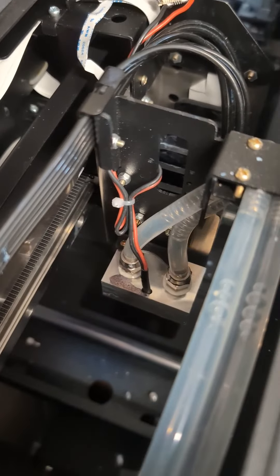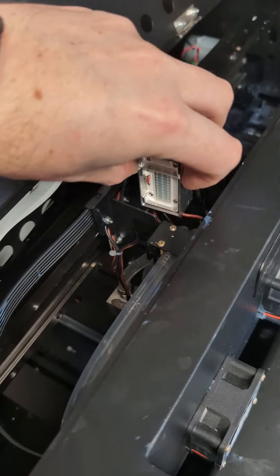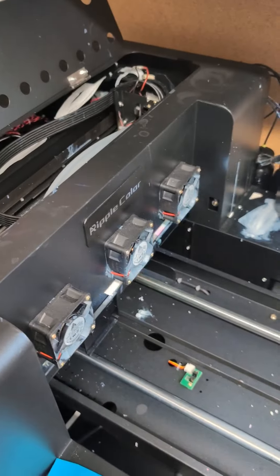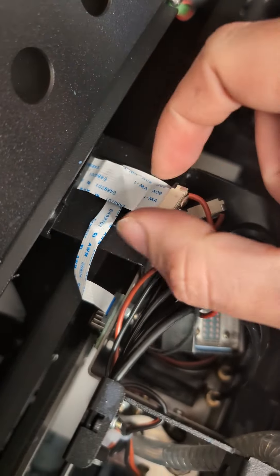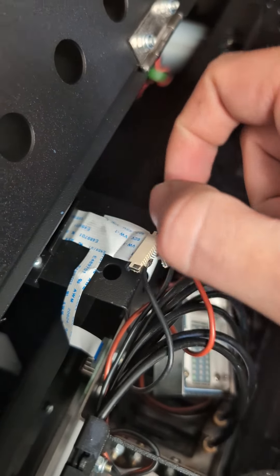Before we commit to removing all the water cooling, I've just connected a new light up here temporarily. It's going to move left and right, but we just need to see if it works — and since it's not water cooled, if we see it working constantly we'll just hit the emergency stop. This will help us prove if it's the light before we do any further work. I've sent a test print and you can see that light also doesn't work. So it's likely not the ribbon cable — which has around 16 pins, so if those broke it would have to be almost cut through. We're likely dealing with the power supplies having failed.